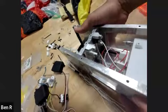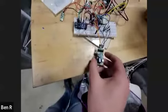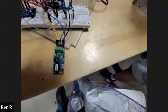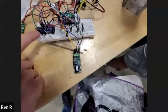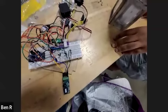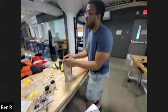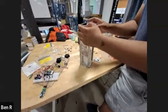The system is redundant: if either cord cutter fires, the main parafoil will release. We also have a second Raven 4 for barometric altitude detection. For each of the four events those are connected to different behaviors on the Arduino Nano, which controls the servos, cord cutters, and cameras via the power distribution board. The Arduino Nano and the second Raven 4 together are acting as a simplified version of the SRAD flight computer we were hoping to develop.